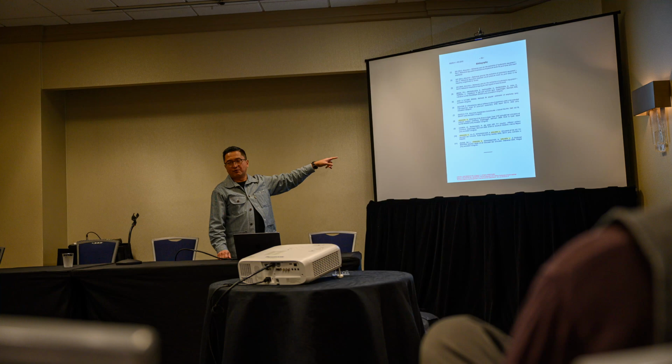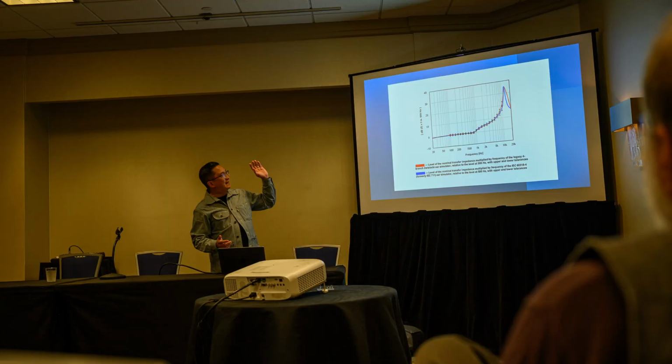And this is where we go back to what ISVR was saying, that the hardware leads the standards. That 4157 from Brüel & Kjær, that 2-branch coupler, by the way, we can't find the original ANSI S3.25 1979. That would be the 711. They're now using that 711 to represent the 2-branch design. You can see it's similar to Zwislocki, so it was pretty easy to kind of figure out that they might be related. We overlaid those so that you could see them. They're not overlaid in the standard.